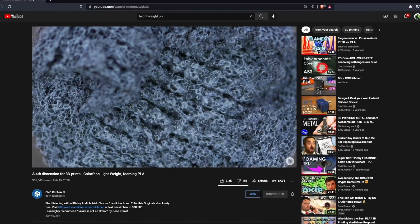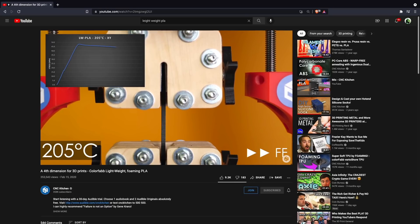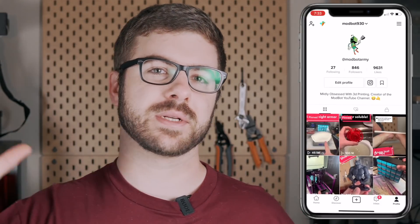There's certainly some crossover between that material and this one as far as how the foaming process works. In that video he covered a lot of different strength tests, and the main takeaway was: yes, the more the material is foamed and the less density it has, the weaker the part is — and that did not scale in a linear fashion. If you're really interested in the strength properties, I highly recommend checking out that video, and I will place the link in the description.